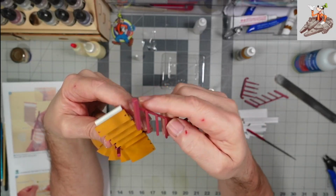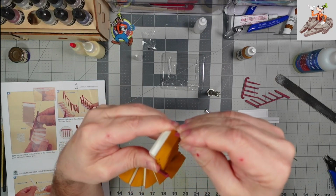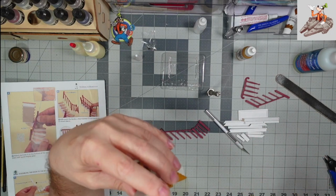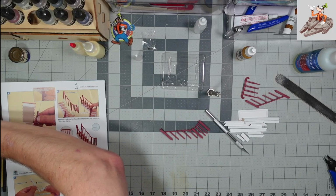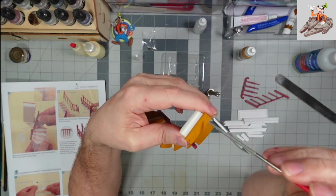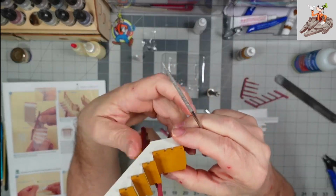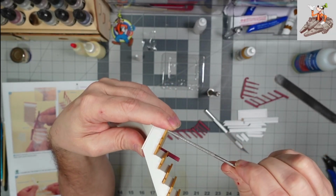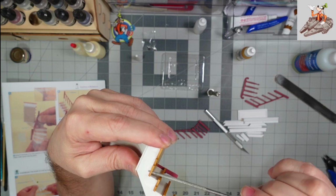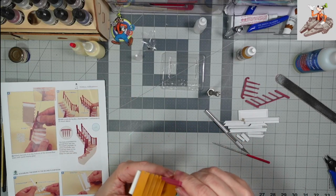Well, this time I'm going to be smarter. I'm going to make sure that the pins will all fit into the holes where they're supposed to. That one can use a little bit of filing. And the holes, I'm sure, were the right size before. What it is, when you paint them, you get a small layer of paint, and it takes a little bit of the room for the pin away. So you have to come back and work that hole just a hair.